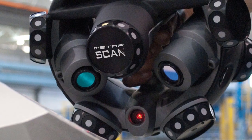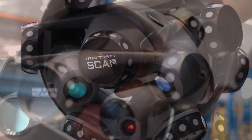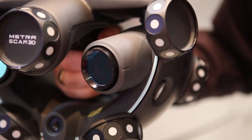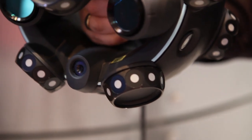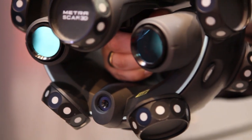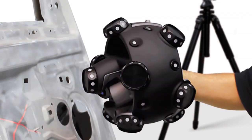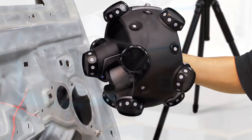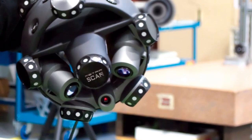What we can do with a portable mobile scan device is to measure or to reverse engineer parts directly in the production area. With the camera device and the laser scanner we are able to scan moving parts. The C-Track will collect alignment points on the part and during the part is moving we can scan it without losing accuracy.